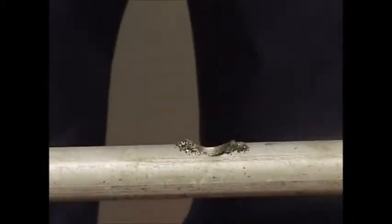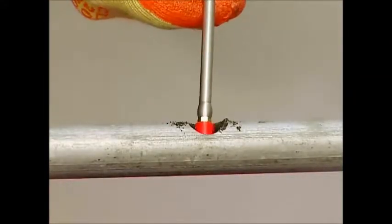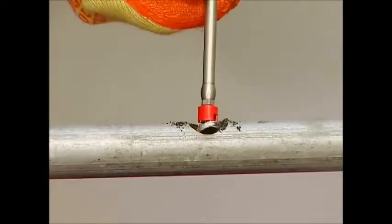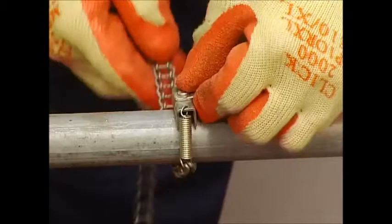Remove the stopper assembly, then remove the clamp. The stopper is now in position and the service can be cut. If the coupon was not retained in the hole saw and is visible in the service, use the magnet to retrieve it. Fit a continuity bond.